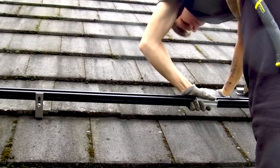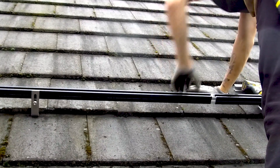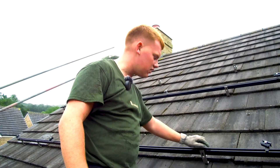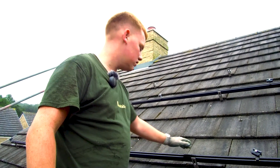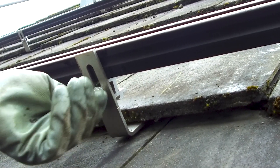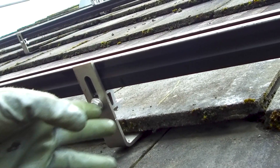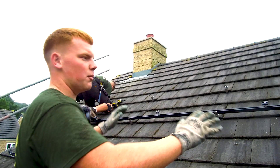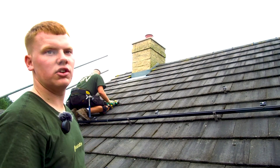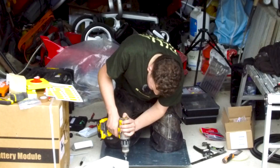Is this one of the better railing systems you've used? Yeah, it's a very good system because they're saving on T-bolts — it's literally an interlocking system into small brackets on the back, clicks into the groove in the rail, and it's just a T-40 drill bit to screw it up and then it all clamps in place. For leveling we go to the top of the bracket, and if the roof gives way over time we can adjust these to level the panels back out when installing.